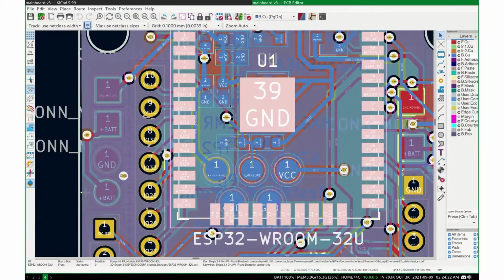The flight controller is likely the most important part of this project. Flight controllers in general are expensive. Even less powerful flight controllers based on older STM32F3 microcontrollers can cost upwards of $25. These flight controllers can't even run PX4. So we knew from the beginning that if we wanted to build a PX4 capable drone, we would need to go completely custom for our flight controller.